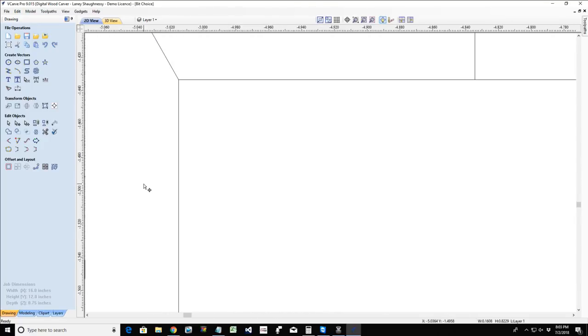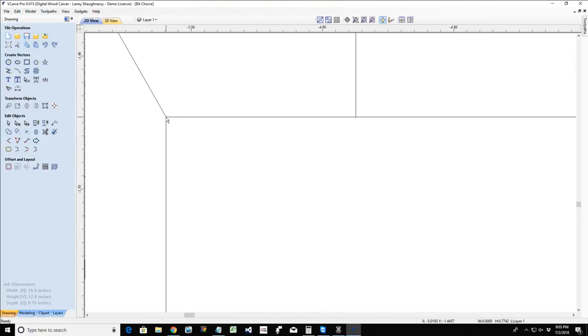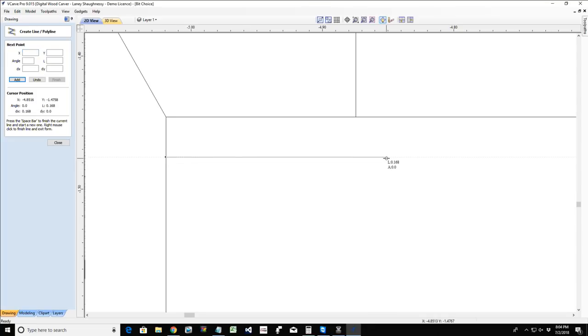if my start point is here, and I set a Z offset, then it's going to make my cut think that it's here. So the only thing I'm doing is offsetting the depth of cut. So when I zero out on the top of my board, if I have my Z offset to something else, whether it's negative or positive, then my bit's going to be cutting either in the air or cutting too deep, because my Z is offset. So generally, you would not set a new Z value offset.